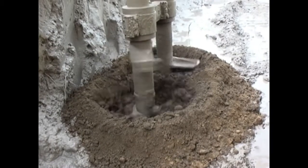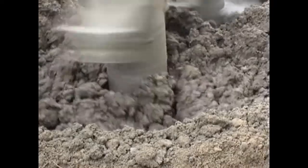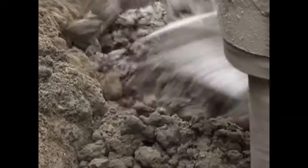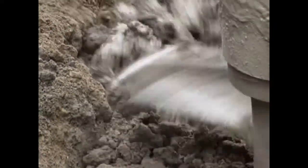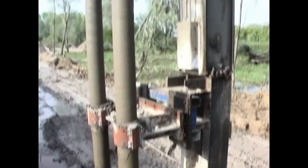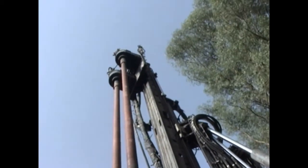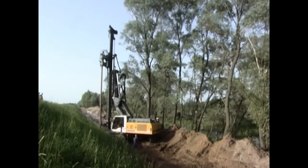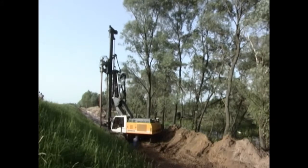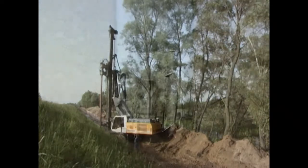In order to loosen the prevailing soil and its structure, and to mix the loosened soil with the binding agent as homogeneously as possible, the mixing tool has to move in a way so as to create shear strain in the soil. This is produced by quick rotation of the knife-shaped and partly contra-rotating paddles or blades. The knives, paddles, or blades are fitted with teeth, cutting edges, or similar depending on the soil type. The mixing tools have to be adapted to the prevailing soil conditions.